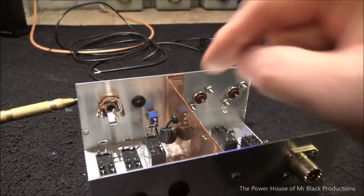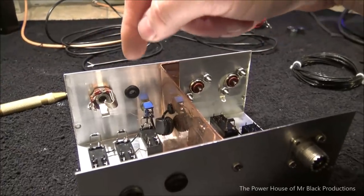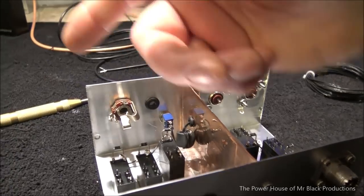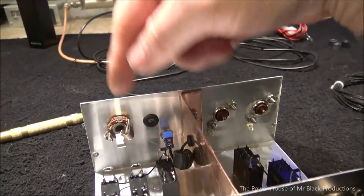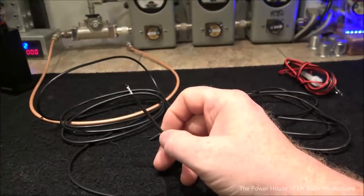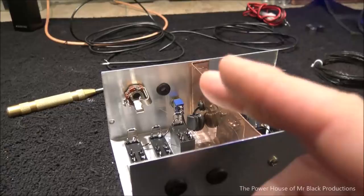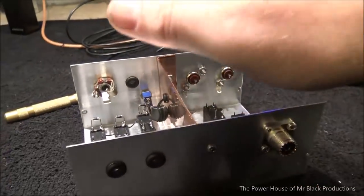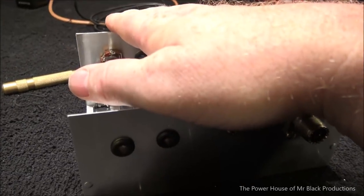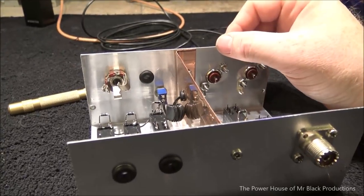But we have to separate the two, and we want this relay to drive everything. We don't want to have an electrical connection back to the case from the trigger, because that can turn into an antenna, which can pick up noise. And because this is going to be running right next to our audio circuit, it can cause us to have a feedback loop, which we don't want. We want this box to be able to sit RF lifted above ground as much as possible. Keep that in mind. That's the reason we got to go to this level of detail.